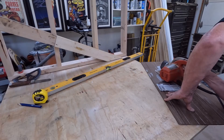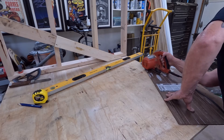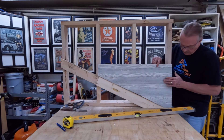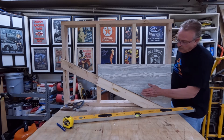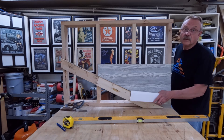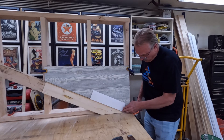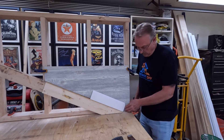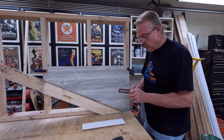So now we have successfully replicated this angle — let's get it cut off. Let's see how that fits. And there we have it — just not a bad looking fit at all. In most cases this would get trimmed anyway, and that is the next angle we're going to figure out. So now let's say we want to trim this out. We want our adjacent piece of trim that's down here into the floor to blend perfectly into this one. For that, we're going to use the miter saw, and now we are going to need to know the angle.